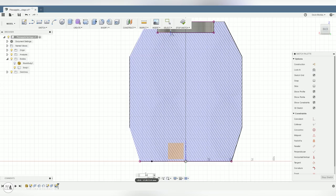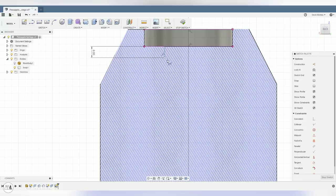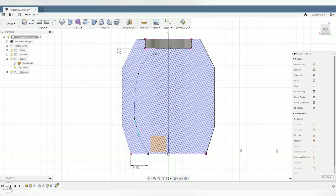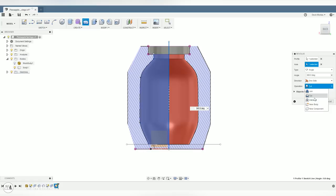Since this is a springo it needs to be hollow in the center, so I'm figuring out how large of a cavity I want to create on the inside of this pineapple. I'll make this 24.5 millimeters, then 8 millimeters below the cut for the end of the springo part. I'll use the spline tool to create a nice rounded spline for the cut on the inside, keeping the wall thickness relatively even, and adjusting the spline so we don't have any overhangs greater than about 45 degrees — that way we can make this completely printable without support material.